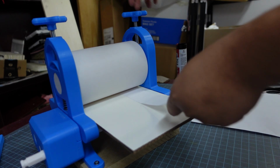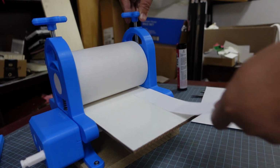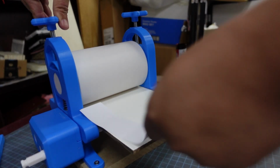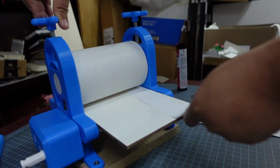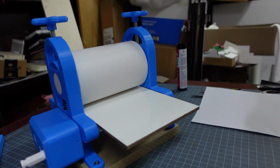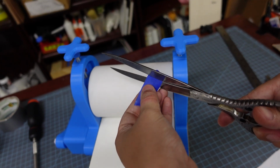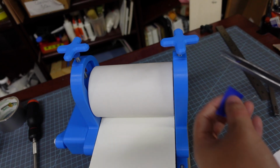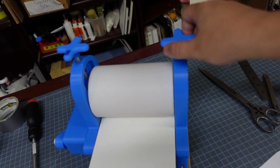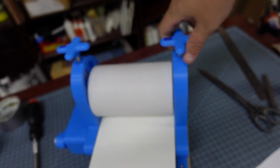And that's when I'll know that the top roller is level and I'll get them in sync. And so usually if you lower one side, it also barely lowers the other side. And so you have to go back and forth to find that sweet spot. But once the knobs are calibrated, your top roller should be parallel with the press bed. And so I'm going to go ahead and use some tape and mark the orientation of the knobs. And so here I'm just going to mark one little part of the knob, and that's just going to let me know where the knob's at in its rotation, and I can turn the knobs in sync and it'll help prevent it from being out of parallel again.